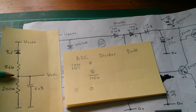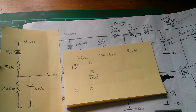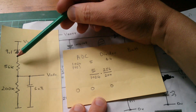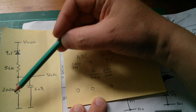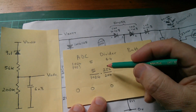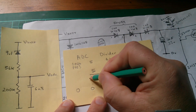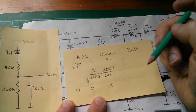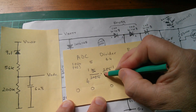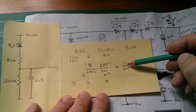That brings us to the external ADC pin, but the point up here will be a higher voltage in the ratio of 56 plus 200 equals 256 - a nice number - divided by 200. That gives us a scale of between 0 and 6.4 volts at this point, giving 0 to 5 volts at the ADC input. Now 256 divided by 1024 is convenient: we can cancel to get 1 over 4. And 5 over 200 simplifies to 1 over 40. That gives us a nice simple result: simply divide by 160.